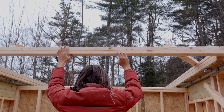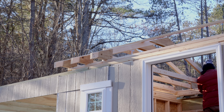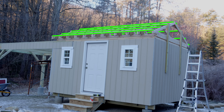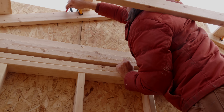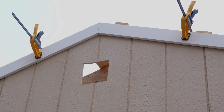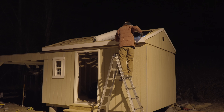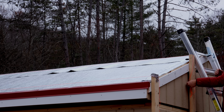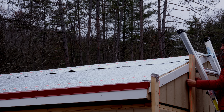With the roof platform rolling smoothly, I was ready to add the previously built roof trusses one by one. When all the roof trusses had been added, I added some long cross pieces called strapping — this is what the metal roof will screw onto — and then added some thinner fascia boards to each edge. On the short ends, I marked and cut more pieces of LP Smart Panels for sheathing, including a small square cutout for gable vents to improve air circulation. I then added blocking to close off the framing on the roof, and stapled some double bubble foil insulation onto the strapping. Since the whole roof is on wheels, I screwed on some temporary bracing to keep it from moving while adding the metal roofing.